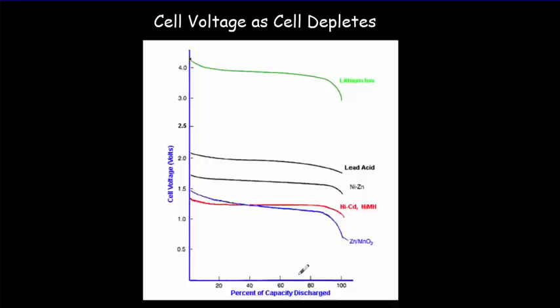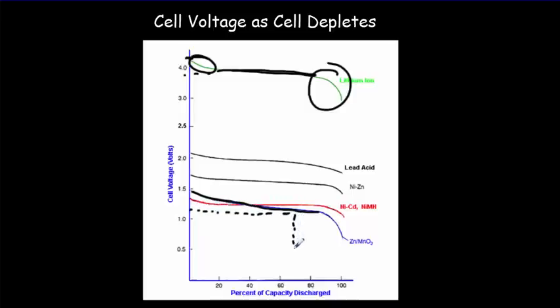You've probably noticed that with a fresh set of batteries, your flashlight burns a little bit brighter — that's because the voltage is a little bit higher when the battery is new. But for most of the lifetime of the battery, it operates at a relatively constant voltage and your device will operate properly. Then when the battery begins to die out, it happens rapidly. For some batteries, the voltage decays more gradually, and for those you could actually use the open circuit voltage to determine how much capacity you have left.